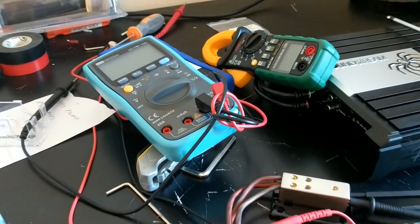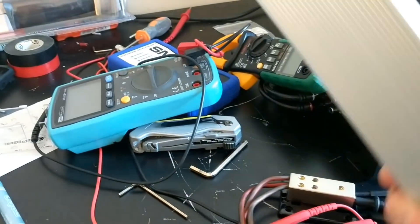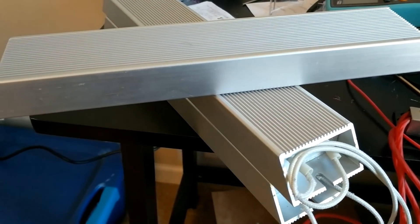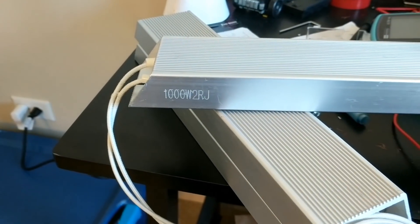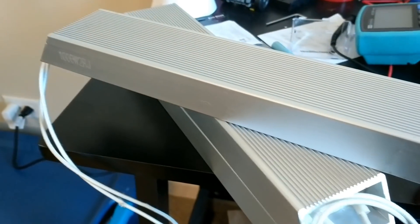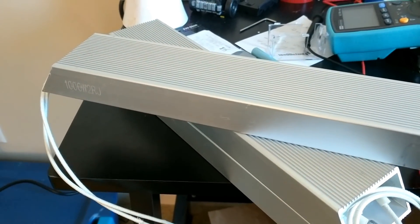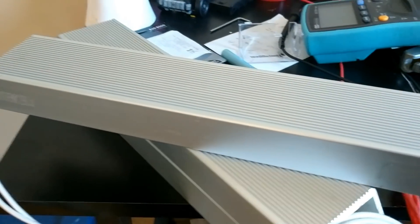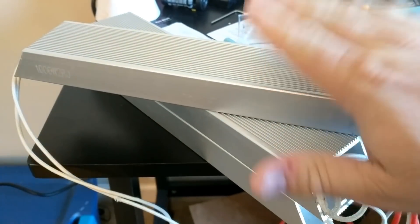Some of you said, okay what do I use for resistance to keep it so stable? Well, those are these jobs here — sorry for the mess. These are braking resistors. Right here I've got two 4-ohm resistors and one 2-ohm resistor. These are 1000-watt braking resistors — this one in particular is a 2-ohm. You might be saying why do I use these? Well, these are the exact same that you're going to find in the AD-1. Tony D'Amore uses a bunch of these inside the AD-1 — when I saw a video of the AD-1 with the top opened up, it had banks of these in there. These are what I use to simulate loads, so there's no box rise.